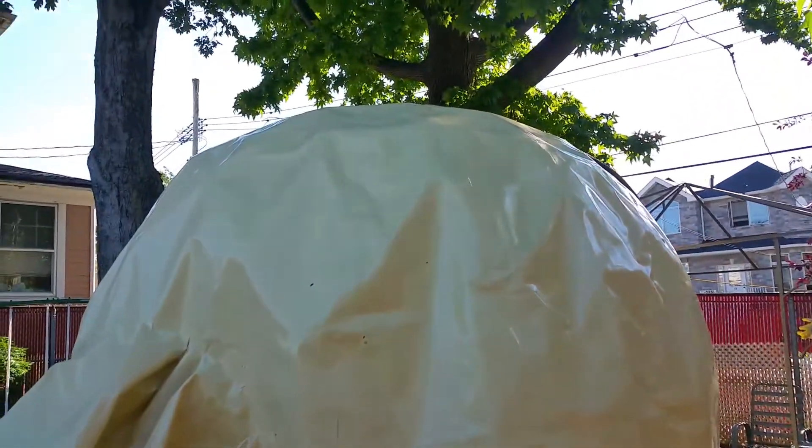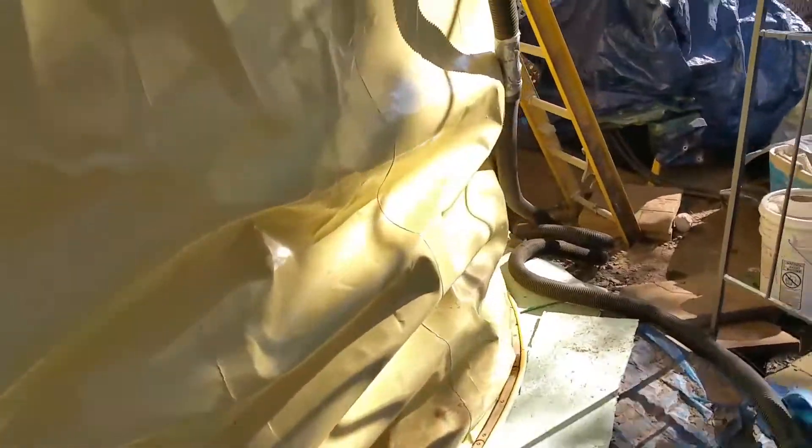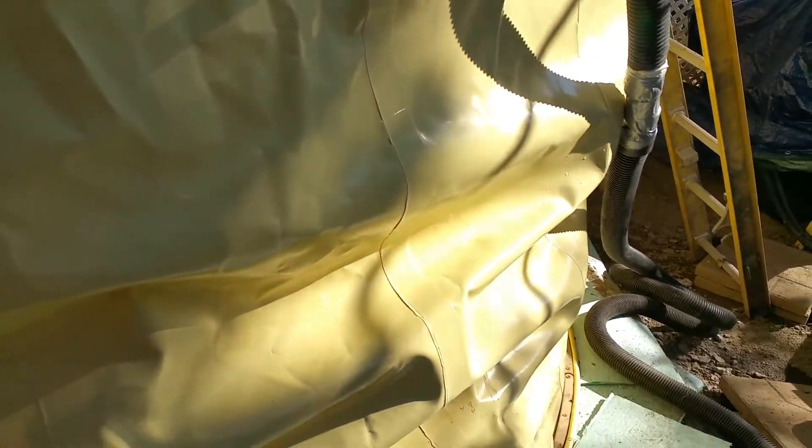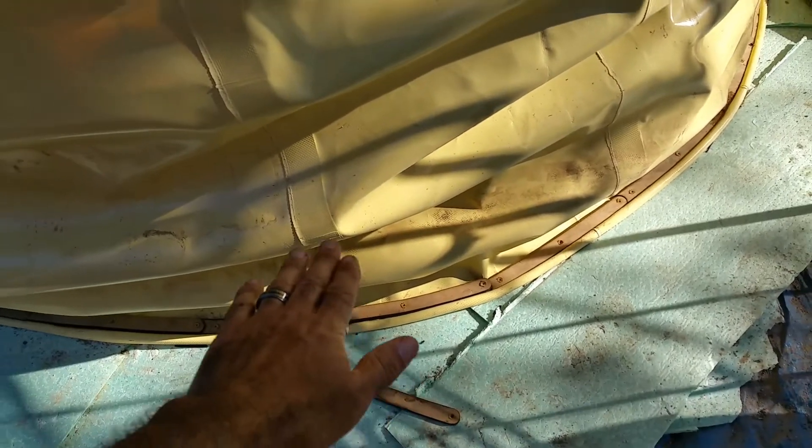It may be all I need to get the aircrete pumped and into the dome. By doing this, this inlet is for my air so it'll inflate it, and this hose I'm planning on sticking in through the top — it'll come down the side and the tip will lay down here at the bottom. As I pump in the aircrete, I'll fill in from the bottom.